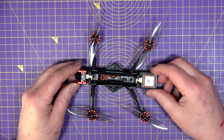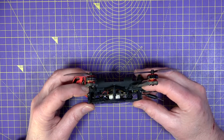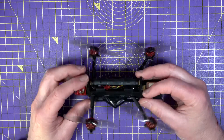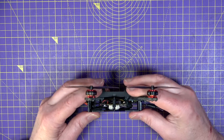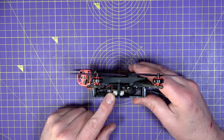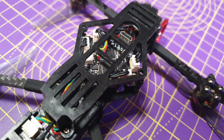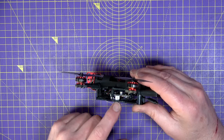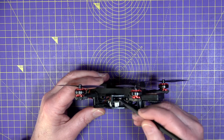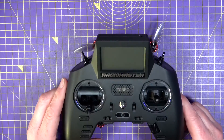This frame is basically an 18650 battery holder fixed to a top and bottom molded plate, with a couple of 3mm carbon arms that are continuous and squished between them. The flight controller is a toothpick-style all-in-one F4 board with 5 amp BLHeli ESCs, and very conveniently there's an ExpressLRS 2.4 GHz receiver on board. You can just see the ceramic antenna mounted on the board, so there's no need for RF antennas, and I'll be using my RadioMaster Zorro to control this.